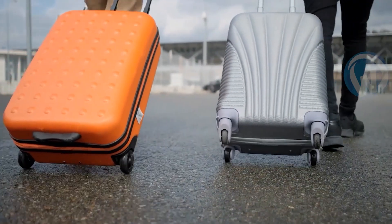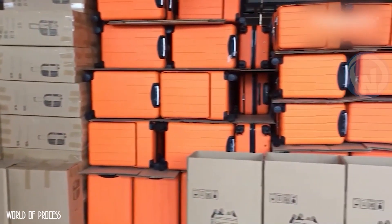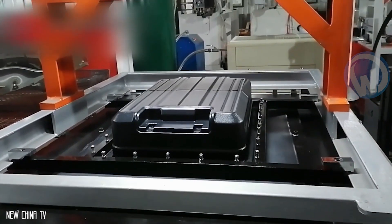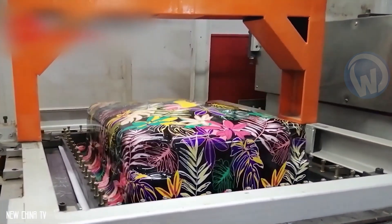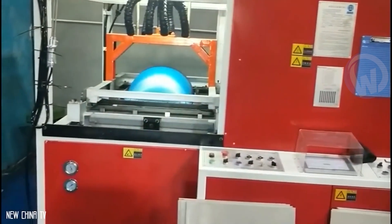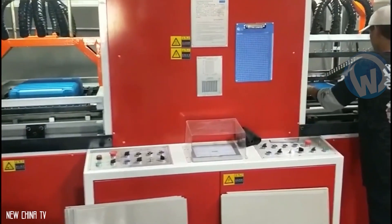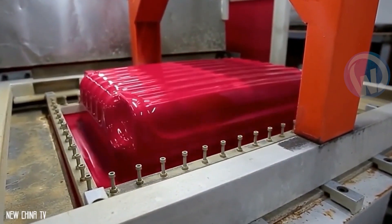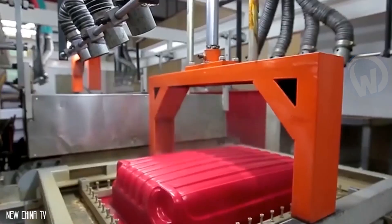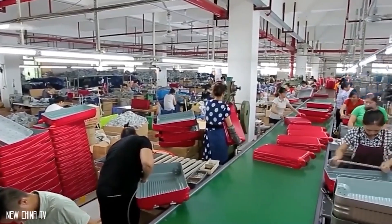This is a Chinese factory that makes suitcases and exports them all over the world. Not so long ago, this factory went viral on social networks due to the unusual manufacture of its products. Suitcases of all colors and with different patterns are manufactured in no time. The factory uses a process that consists of blowing a heated plastic sheet through a vacuum-forming machine. Thanks to this machine, the structures of the cases are formed and then assembled before the finishing stage.